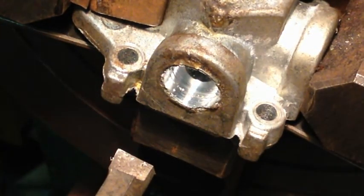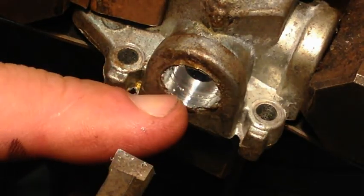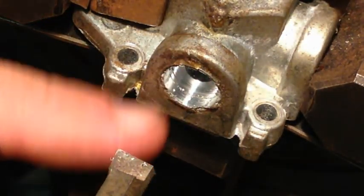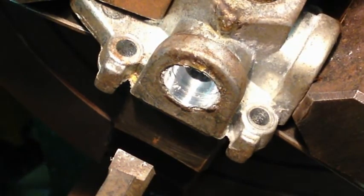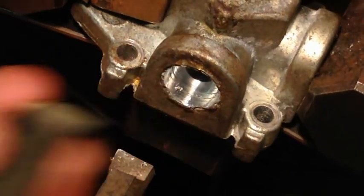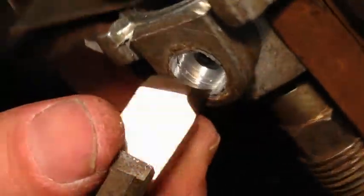What you need to do is actually pick up where the thread is. So what you do is with your lead screw in gear you get your timing right so you can pick up on the actual internal thread, otherwise you'd have to do the next size up hole — and again we wouldn't necessarily be able to get that. We'll probably screw it up if we don't pick this thread up. So we're going to start trying to pick at the thread, and if we can't do that I'll try and set the threading tool up to pick up on those threads.